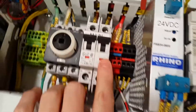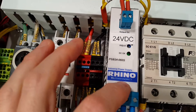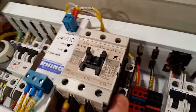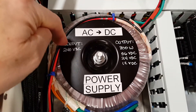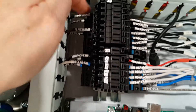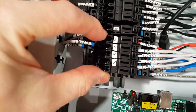This is the AC bus after the breaker. Power from here feeds the DC power supply, which runs the latching circuit through the e-stops that control the contactor, with the contactor's auxiliary contact participating in that latching circuit. After the contactor, the bus feeds two circuit breakers — one for the DC power supply and one for the VFD. Power comes over to the Antec 800-watt linear power supply, which outputs 56, 24, and 12 volts. That feeds into the DC bus, with circuits for 12 volt, 24 volt, and 56 volts to drive the stepper motors.